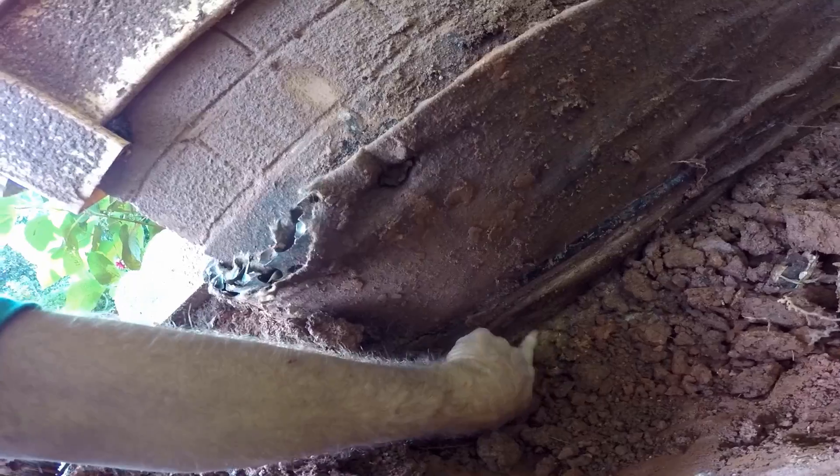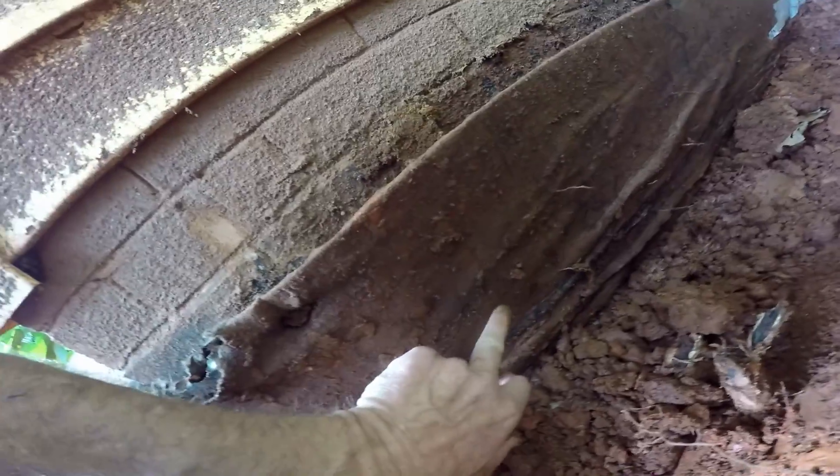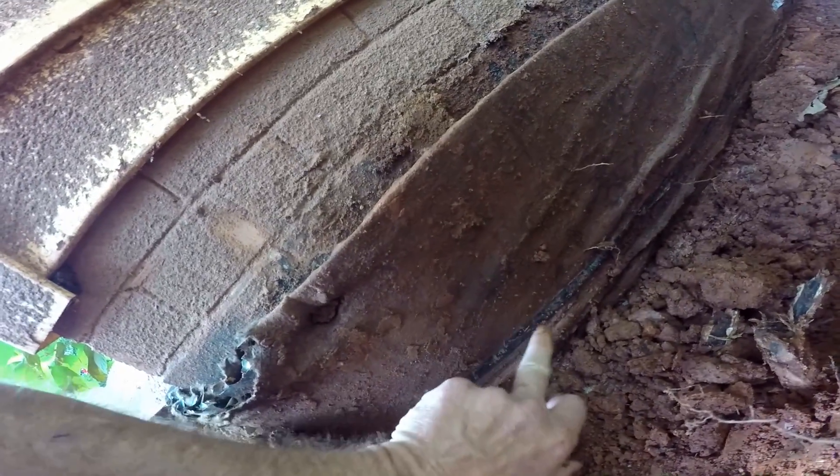Again, this is called strip drain. And if you look carefully down here, you'll see there's water — it's trapped inside here. And not only that, you can see how much clay has pushed against it. Water cannot possibly get through there fast enough for anything to work. You can see the mud. This is just sticky, wet mud.